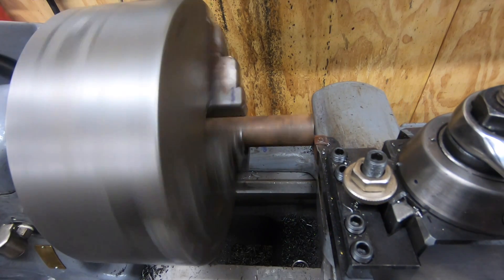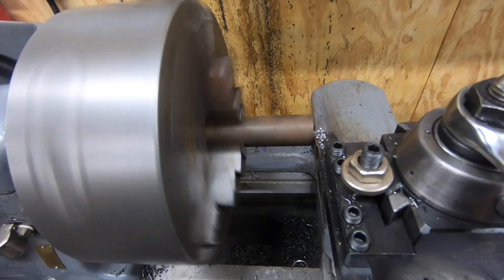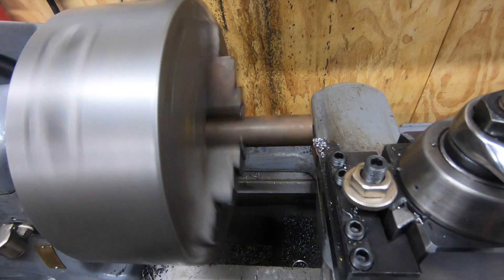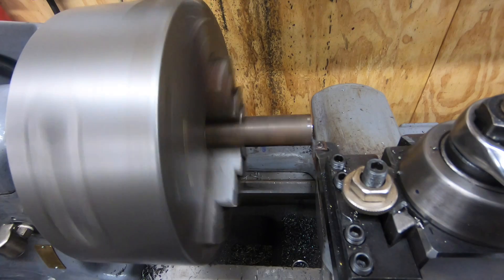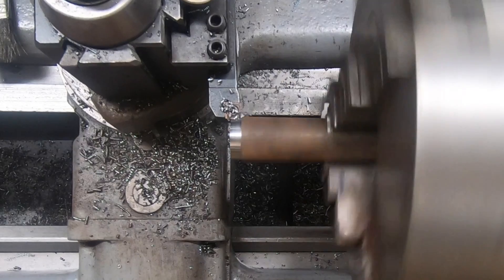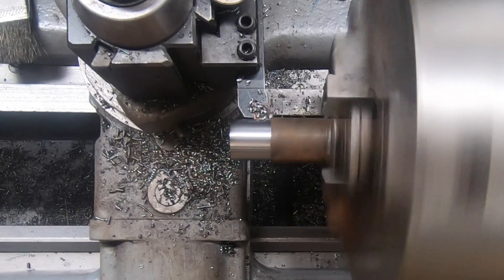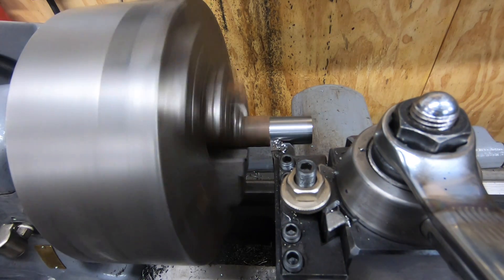It's a well-known tradition amongst hobby YouTube machinists that you must face off the part first before machining it. I need to take about 250 thousandths off the diameter, so we'll start with a nice healthy 50 thousandths depth of cut - that's a hundred thousandths off the diameter. This must be some type of free-machining or leaded steel because I'm getting a really good chip at that depth of cut, so I know it's not something like a 4140 which I usually have a lot more problems with.